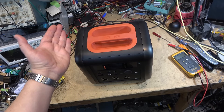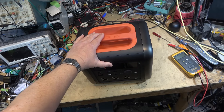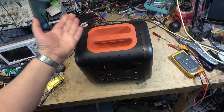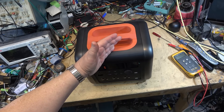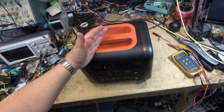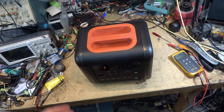Anyway, this is what can happen if you buy one of these battery packs. Keep in mind that you've got to use them or at least put them on charge. The manufacturers suggest a top-up every three months; I would say every six months. If you're going beyond six months without putting it on charge - even if you only charge it for half an hour - you don't have to charge all the way full. The sweet spot is between 30% and 80%. You don't want to let them sit with less than 30% charge, and you don't really want to have them overcharged either.